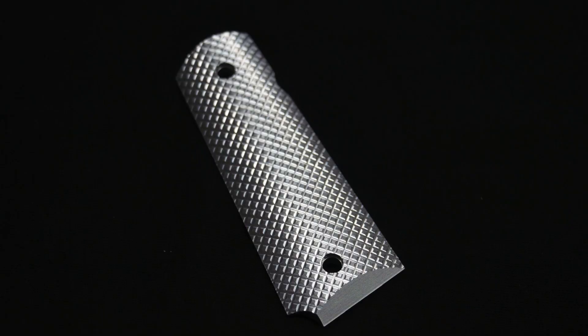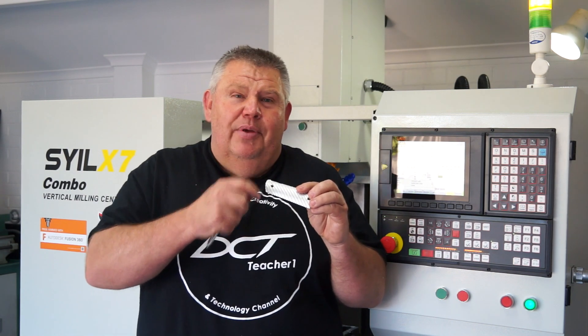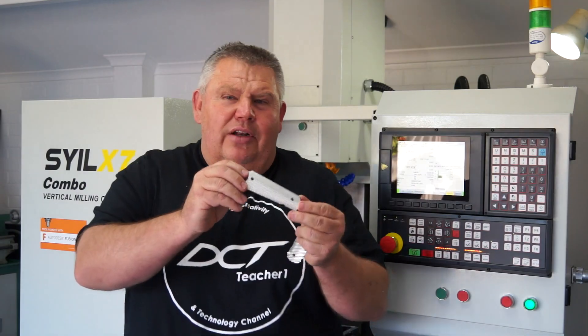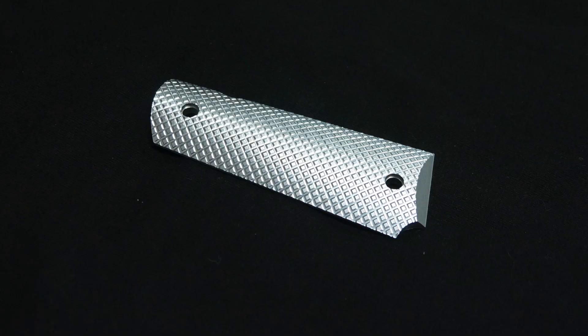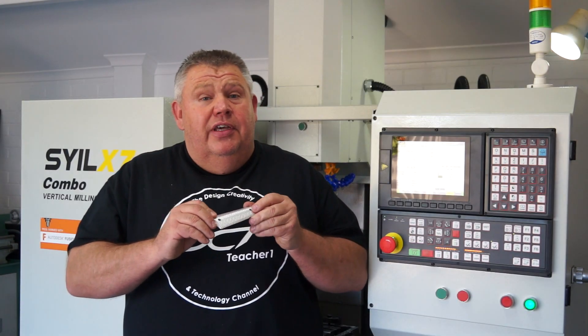She's all finished — take a look at that. I'm really happy with that one. However, I'm not so happy with this one. This was a little bit too savage — Kev programmed that at negative 0.57 and it was just too aggressive for the little 3mm bore mill. It actually came loose in the fixture. I amended the program in Fusion 360 and gave it negative 0.1. The knurl's not bad — I'm really happy with it overall.